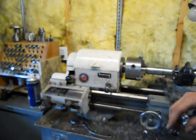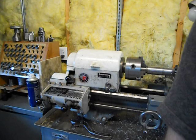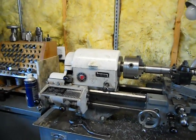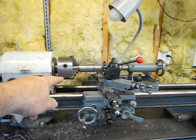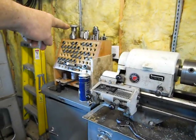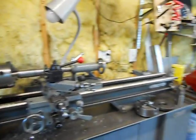It's a three-phase motor but it's got a static phase converter. I have heard concerns about the static phase converter — that you get one third less power out of the motor. Well, this motor's got more than enough power for anything the tooling can handle, so I don't think that's really an issue. I've mounted a lot of different things on here. The nice thing is the bed length — it's the long bed, and the bed will admit 36 inches between centers. It does accept 4C collets; I've got a whole rack of them over there and a collet closer, which is that pulley-looking thing right there. I'm not necessarily going to sell all of this with it — that would be extra.